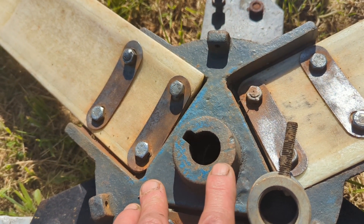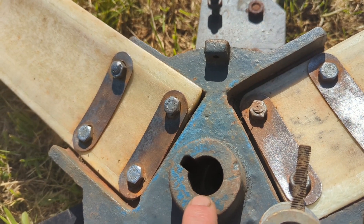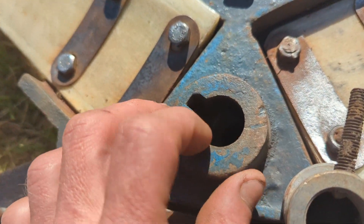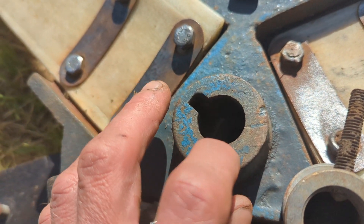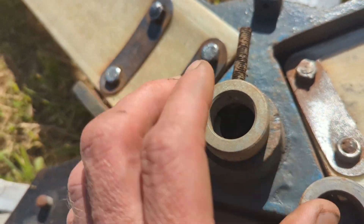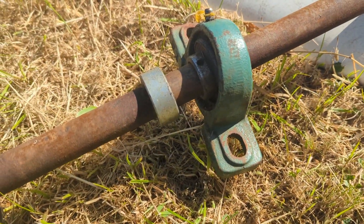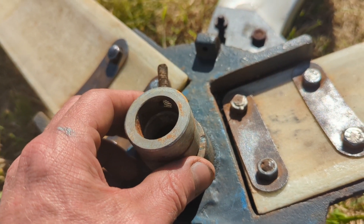The Chinese wind turbine had a tapered shaft, which I'll show you in a minute. It's 24 mil wide at the top where you can see here, and the shaft is 25 mil. It starts at the bottom as 27 mil and tapers to 24. So if I can fairly accurately remove one mil from around there, I'll use these collars. I've got three at the moment, I might have more somewhere.